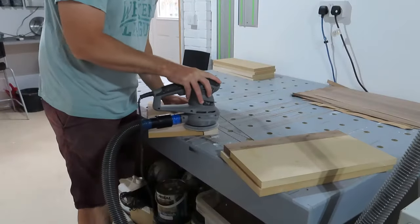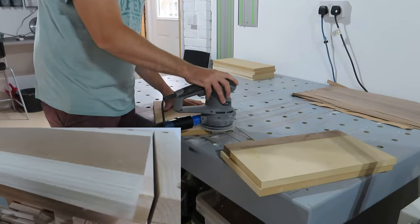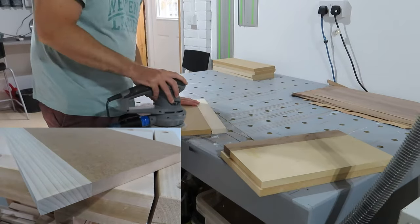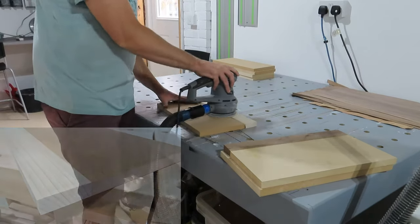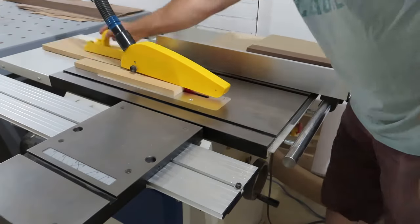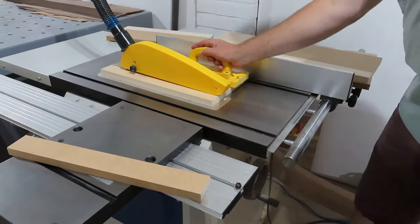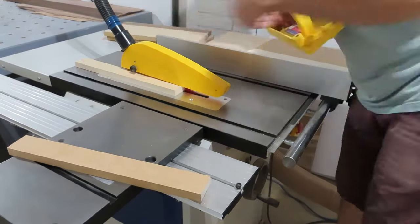We'll leave this one now and come back to it a bit later. Time to see if the other stuff's dried and give it a good sanding. If you want to start doing more veneering, this is definitely a skill you want to have in the bag. Putting hardwood edges under veneer means you can create round overs, put different profiles in, or just give it some protection if it's a high traffic area that's likely to get bumped around.